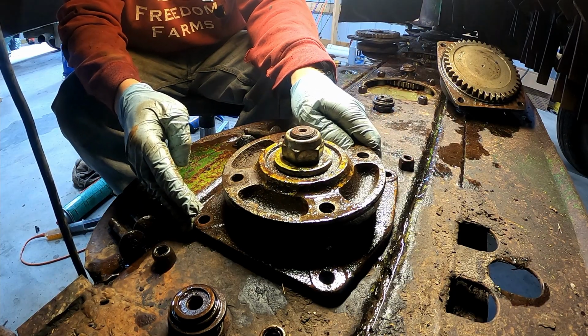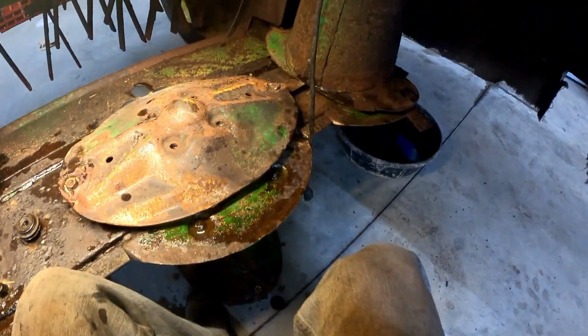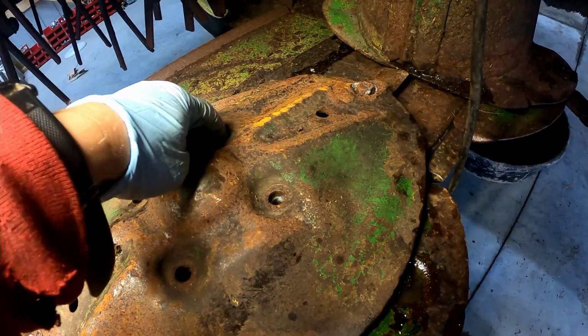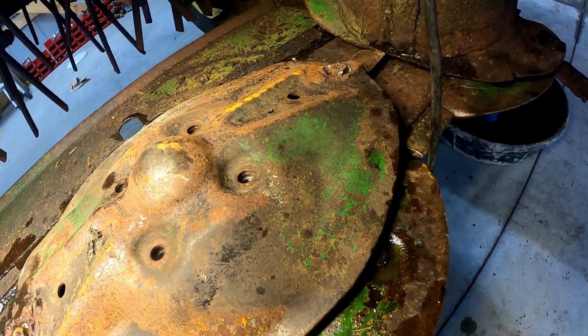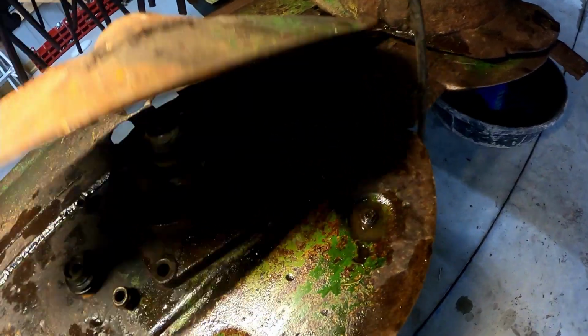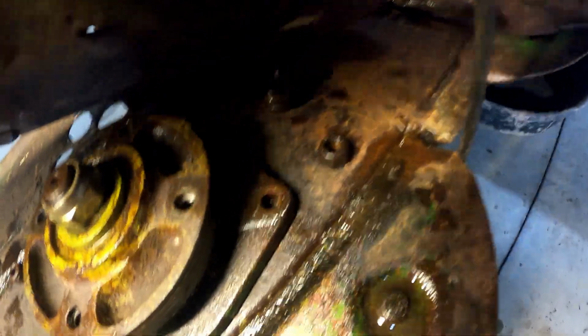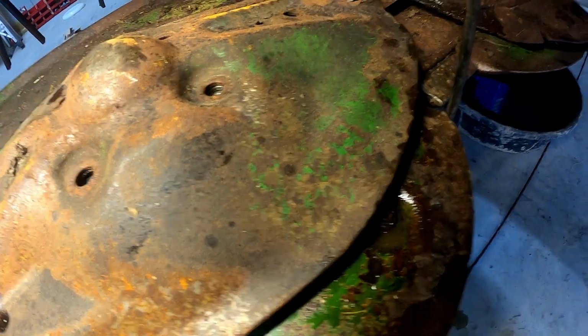Okay. Nope. I'm off by. So from this side, hopefully you can see it well. This turtle, you want to make sure all your bolt holes are lined up. You can even put bolts in there if you would like, but for the most part, it's relatively simple to ensure. Same thing with this. I want to make sure that I'm lined up on my bolt holes, which I'm talking about the bolt holes that hold the hub down to the cutter bar.